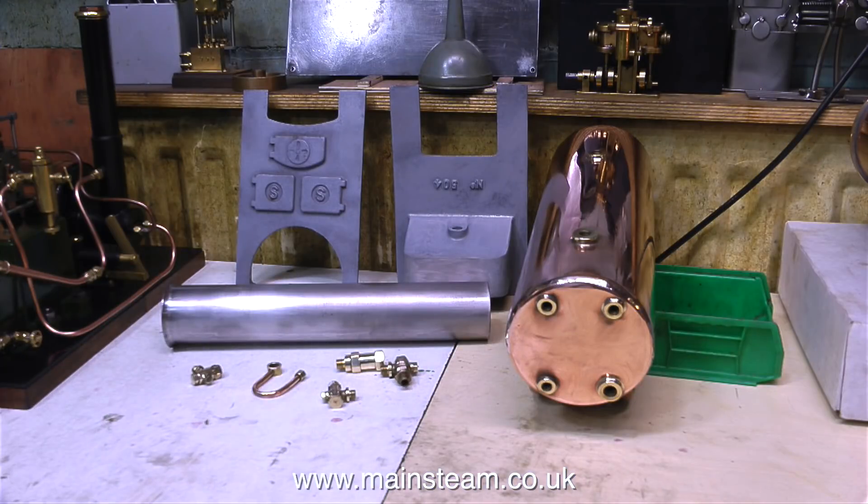Here is a collection of the parts for the boiler: the boiler barrel, the two cast iron mountings, the nicely clean chimney, and the brass fittings. The next job is to test the boiler. In order to perform a hydraulic test on this boiler, I will have to make some blanking plugs. I have a lot of blanking plugs, but they're mainly designed for locomotive boilers that don't use the same thread forms as Stuart Models boilers. I'll show how I make them and what the actual threads are in the next episode. Thanks for watching, and I hope you found it useful.